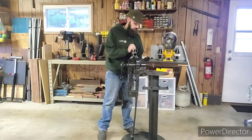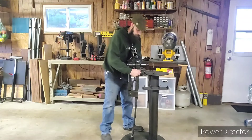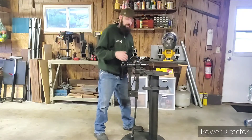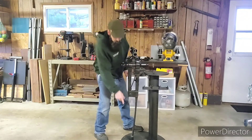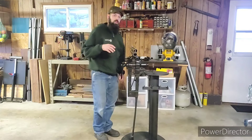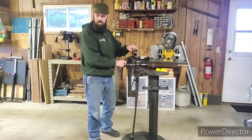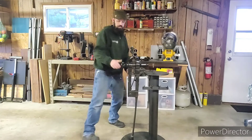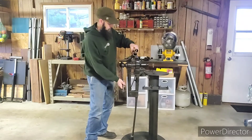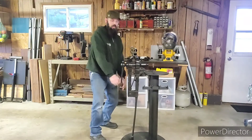The part that is mounted in this pedestal is more like a collar. There is a piece inside and a shim that locks the C-shaped part against the front part of the collar, so it's wedged in pretty tight. However, you do have the potential to pull this entire unit up and out of whatever it's mounted in, whether that's a piece of tubing like I have here or a hole in the concrete. So whenever using this vise, never pick it up — if I'm going to loosen the vise, I push down to open it, and push down to tighten it as well, rather than pulling up.